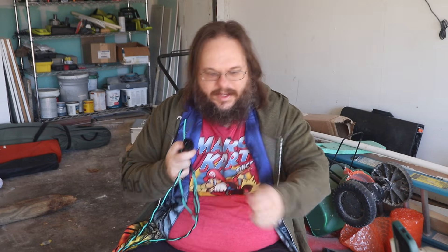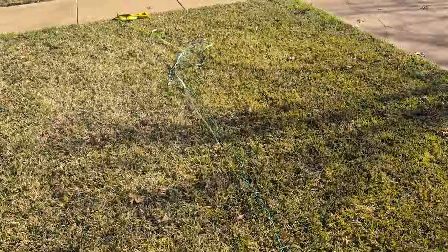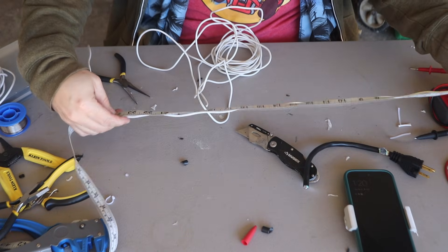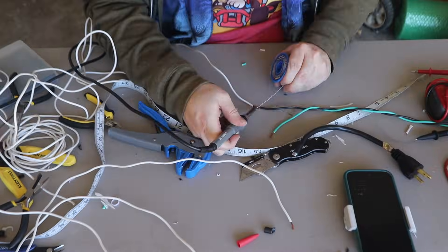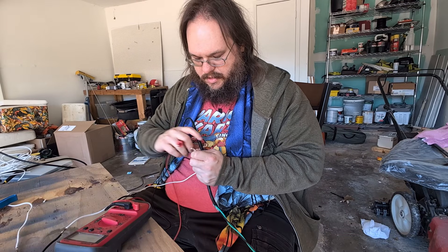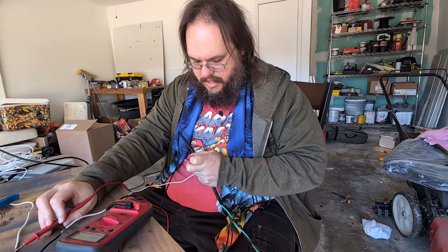This other end is the plug end, and this is where we'll solder the additional black extension — so when we plug it in, that gives us our 20 meters. I went ahead and measured the cord on the ground: it came out to 24 feet 4 inches, so I'll round down to 24 feet. We need a 26-foot first element length for the 17-meter antenna, so I'm going to cut two feet and solder it onto each end, giving us 26 feet for two wires.